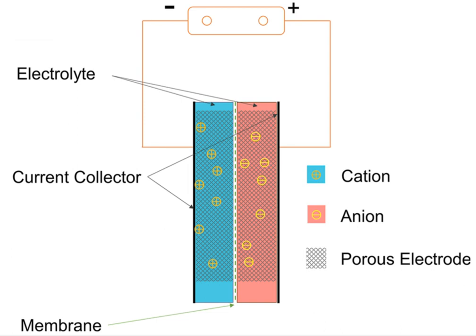In the early 1950s, General Electric engineers began experimenting with porous carbon electrodes in the design of capacitors, from the design of fuel cells and rechargeable batteries. Activated charcoal is an electrical conductor that is an extremely porous, spongy form of carbon with a high specific surface area. In 1957 H. Becker developed a low-voltage electrolytic capacitor with porous carbon electrodes. He believed that the energy was stored as a charge in the carbon pores as in the pores of the etched foils of electrolytic capacitors.